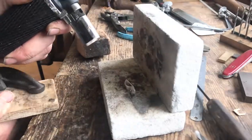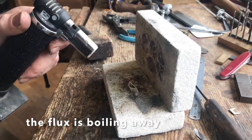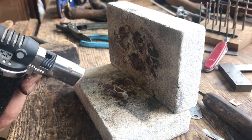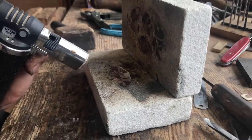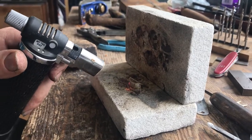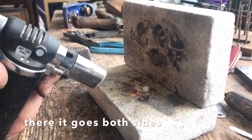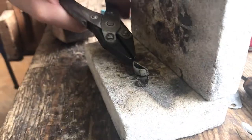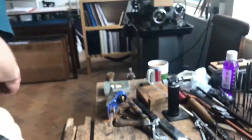You can see how the flux is boiling away. Keep the flame moving around the ferrule to heat it all up evenly, and the ferrule will go to quite a strong red colour. The solder is starting to melt — there it goes, both sides. Just let the solder run up all the way, then switch off. Now I can take the ferrule and quench it.